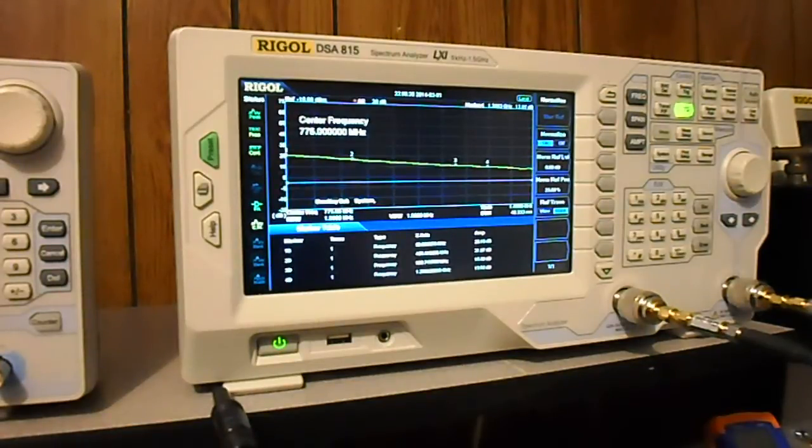The only difference is this one doesn't have as much gain way up on the high end, but in my case that's not such a bad thing because I'm working with weather satellite image reception at 137 MHz. Up to about 1296 MHz the gain is around 14 dB — it's a ham radio thing.